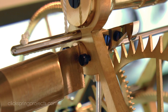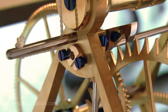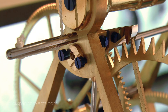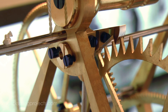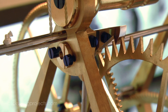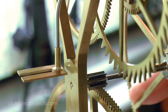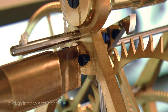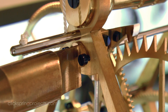And here's a closer look at just how useful that eccentric bushing can be. In this first shot, you can see that the drop onto the entry pallet is quite significant — certainly more than it should be, wasting a lot of energy. But with a slight turn of the bushing, the drop can easily be minimized for maximum energy efficiency. The escapement feels nice and sleek; in fact a light touch on the center wheel is enough to set the pallets off and running, and the bushing can be further adjusted so that the teeth just pass the pallets.